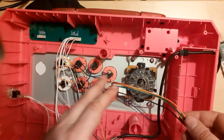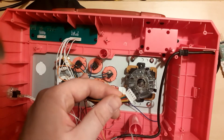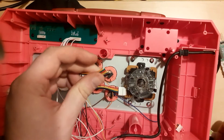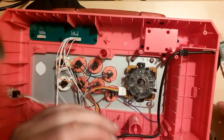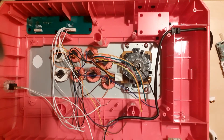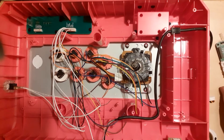Now let's take a look at the joystick — final step. Cut the wires sticking out of the joystick at the base. When it comes to joysticks, there are some discrepancies with the color coding. The schematics may be different based on model, year of production, brand, etc. But no worries — we will test it later and make adjustments. For now, follow my standard schematics. What we know for sure for any joystick is that the black wire at the bottom is the ground. So now we know the location of all three grounds — let's start connecting them.